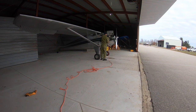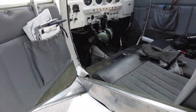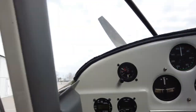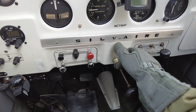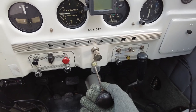With that done, I'm going to leave the oil plugged in a little bit longer. I'll do a quick but thorough preflight even though it's cold, and then we'll push it out and go over the modified start procedure. The airplane's preflighted. Just unplugged the oil heater — you can see we're registering a temperature. It's not hot, but it's over 40. So that's good. First, make sure master's off, mags are off, mixture's in.